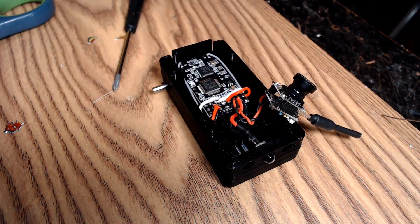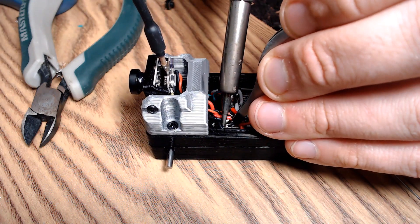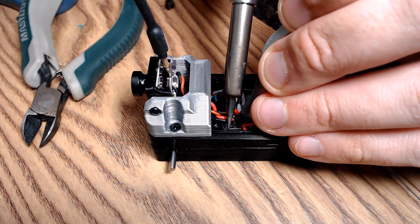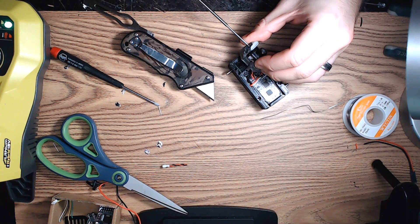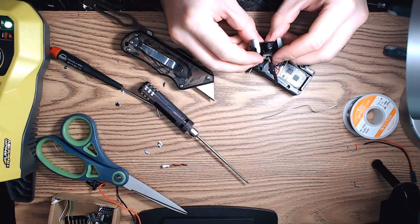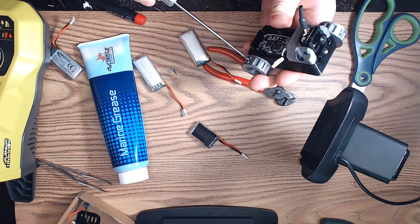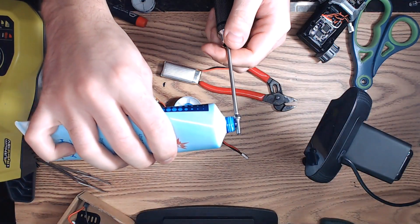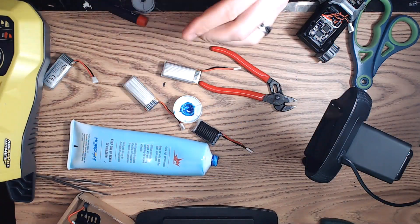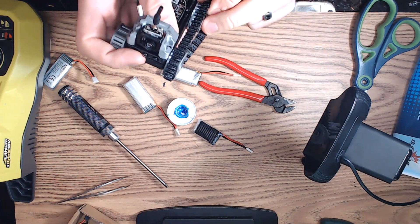Additional LEDs may also be added, with up to three in this chassis. Our final bit of soldering is the power connector, which will again be soldered to any of the remaining power pins. At this point the wiring looks a bit of a mess due to the limited space, so here's a diagram showing how everything is hooked up. Once wired up, I secure any LEDs with a small drop of super glue, then attach the camera mount to the front and screw it into place. The drive wheels slide onto the motor axles with a small set screw to ensure they stay tight on the shaft. The idler wheels use an M4 by 20mm screw to mount. I recommend a small dab of grease to prevent squeaks and wear. Then the tracks are slid on, and it's time for testing.